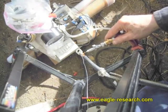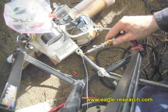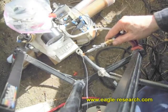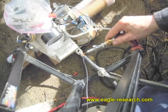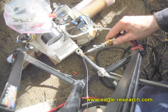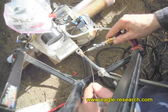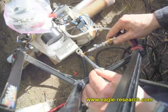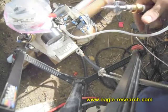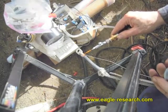We want the flame - that little feather in the middle of the flame - to just touch the metal. You don't want to get too close because you don't want the flame velocity, the gas velocity coming out of the torch tip, to get too low and then cause it to backfire. Okay, here we go, just start feeding in that solder. Get some more, feed it in there.